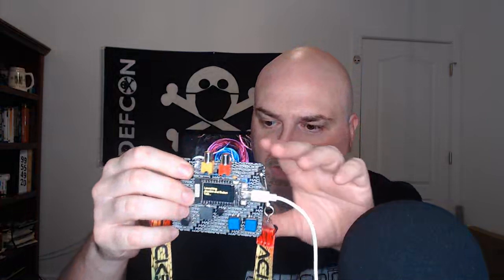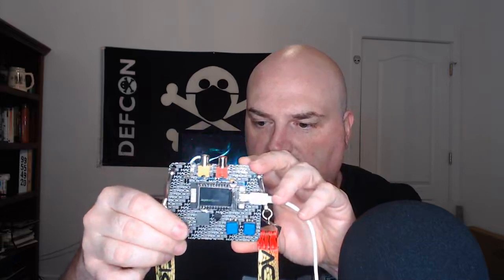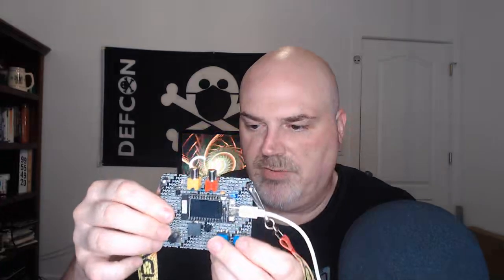Another simple sketch to try is the joystick sketch from the box guide, which displays the state of the joystick on the display. We've loaded it — it launches a joystick test, and when you push the joystick up, down, left, right, or press the center button, it shows it on the display. You can also use buttons A and B, hold both down, combine directions and center simultaneously — whatever contacts you close on the joystick and switches, it puts it on the display. This lets you verify that your soldering is right and all connections for the joystick and two buttons are correct.